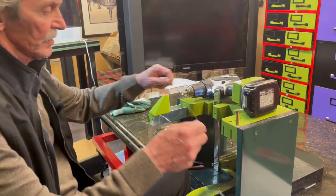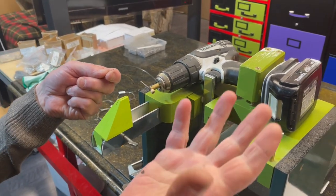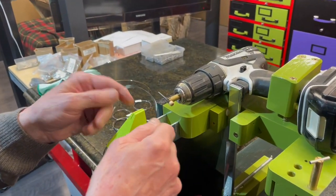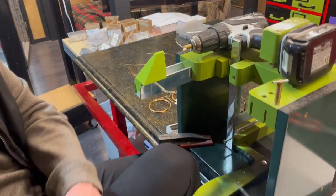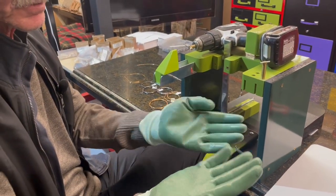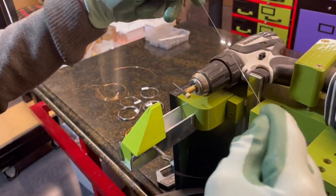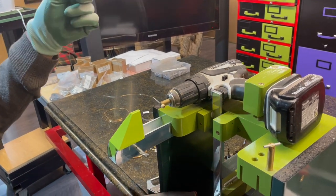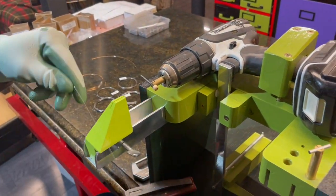We're dealing with a very fine wire — I think it's 0.27 millimeters. You can hardly see it. And just using your bare hands, they sometimes have a little grease or a little sweat, so you don't have enough friction to hold the wire. In order to get rid of this problem, I suggest using gloves that have a vinyl coat, which creates a very nice friction. I also use my glasses.